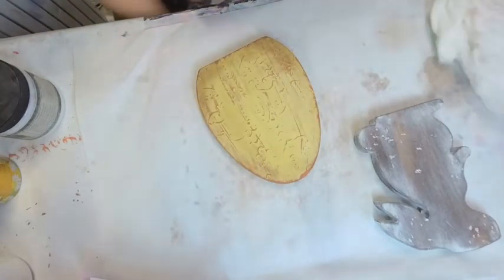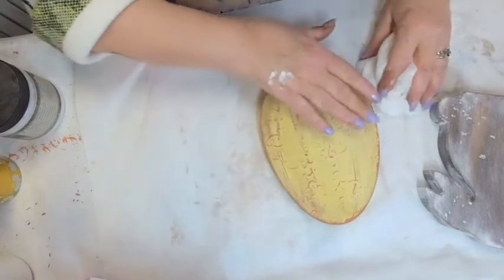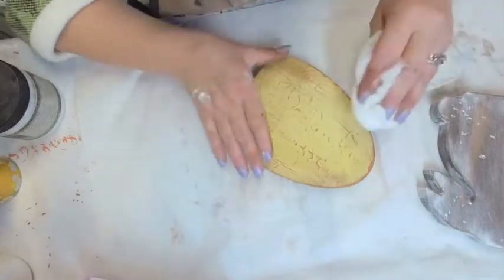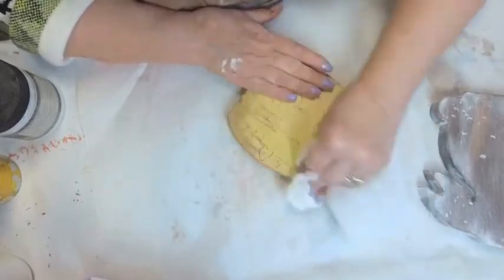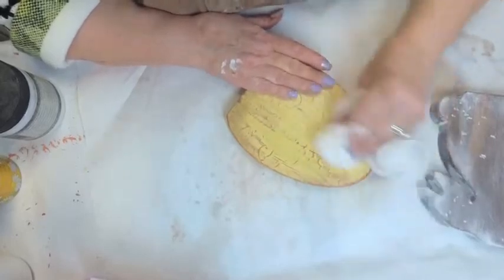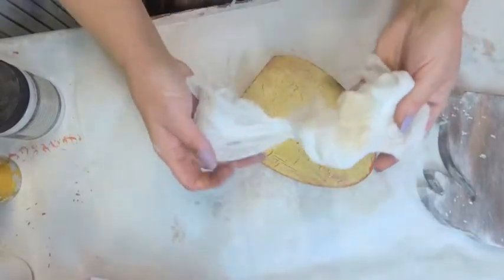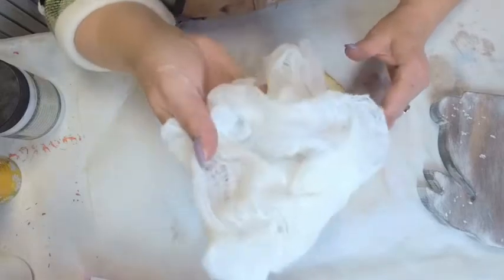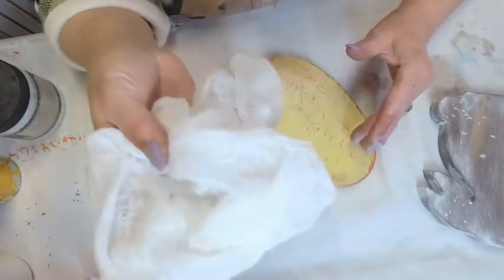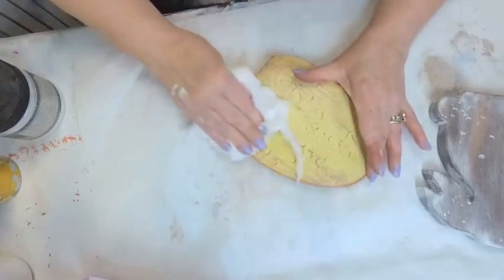My grandmother was Pennsylvania Dutch — she used to say 'egg' in a special way. We've got our dark wax around the edges and we've clear waxed it already — let's start buffing. It's picking up the shine really nicely. And you see I'm picking up a little of the dark wax on my rag. This rag too will either need to be put in a sealed can, put in a can with water, or left to air out before disposal — solvent waxes are combustible.